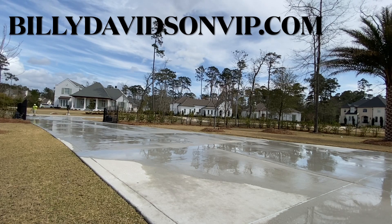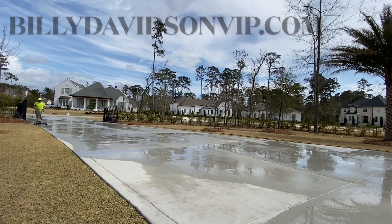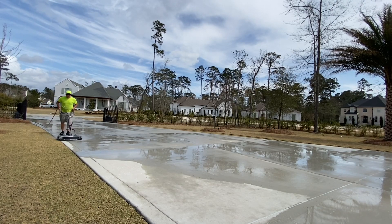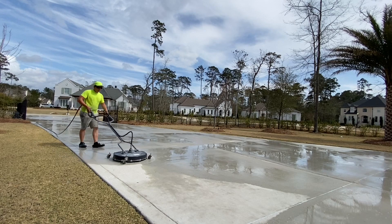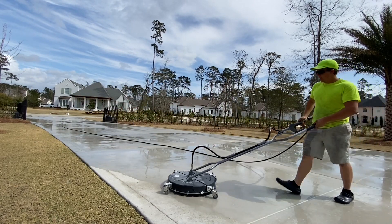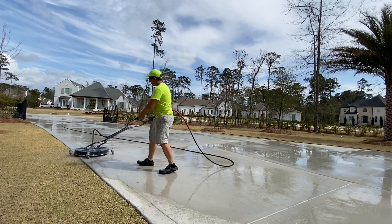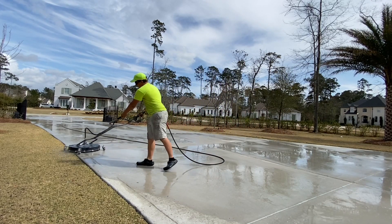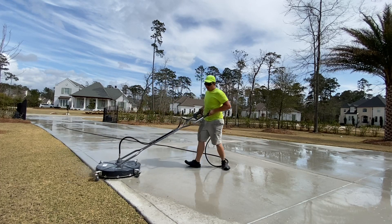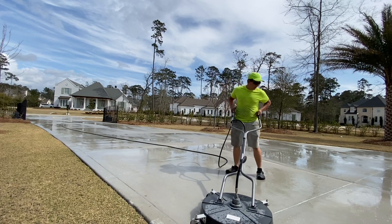Down streaming a driveway is really not effective at all. One of the most effective ways to pre-treat concrete and get between that two and four percent sodium hypochlorite is with a soft wash system. Another very effective method is an X-jet, which will allow you to achieve at least two percent and even more. You could also use a pump-up sprayer — that would take forever, but you can get it done.